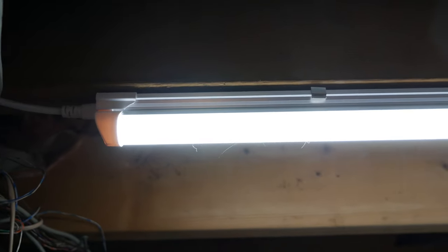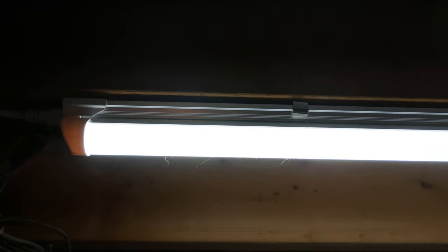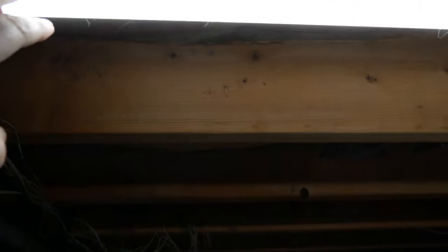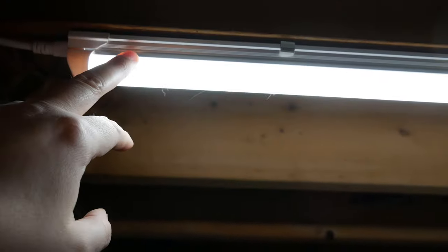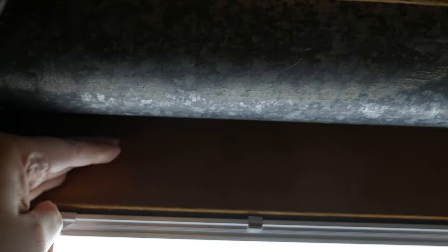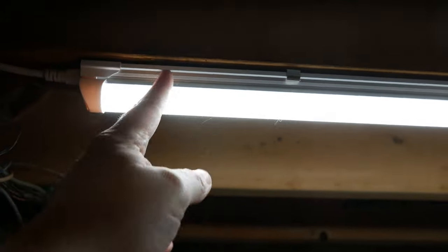Before hanging the rest of the lights, let me mention why I hung this one dropping straight down. You already saw my head bumping into the ceiling — so why lower it by another inch? Well, this light radiates out in 180 degrees from its base. If I mounted it up against the beam, a lot of the light would have been cut off — shooting up to the top of the ceiling where nobody needs it, and blocked by the beam itself. So by mounting on the bottom, even though I risk bumping my head, they radiate the most light.